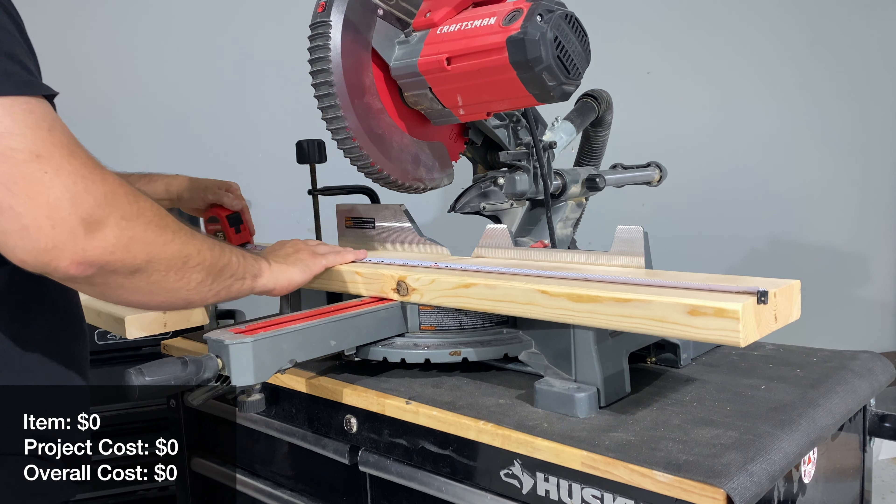Now that that's done, we can comfortably get back to joining the boards. I'm joining each of the boards with dowels, and I'm using a Milescraft doweling jig in order to make that possible. This jig will allow you to drill a perfectly centered hole, which is where the dowel is going to sit. Then you'll need to put your tool on the dowel and lock in the thickness of the wood using the little red accessory. After that, you can clamp together your two mating boards, and this will allow you to use your tool to drill each corresponding dowel hole. Remember how we measured the thickness of the wood? This is exactly what that helps with. If everything was done right, your boards should line up perfectly. After the legs were done, I gave the same treatment to the top of the bench — the same process, but with more dowels for added support.